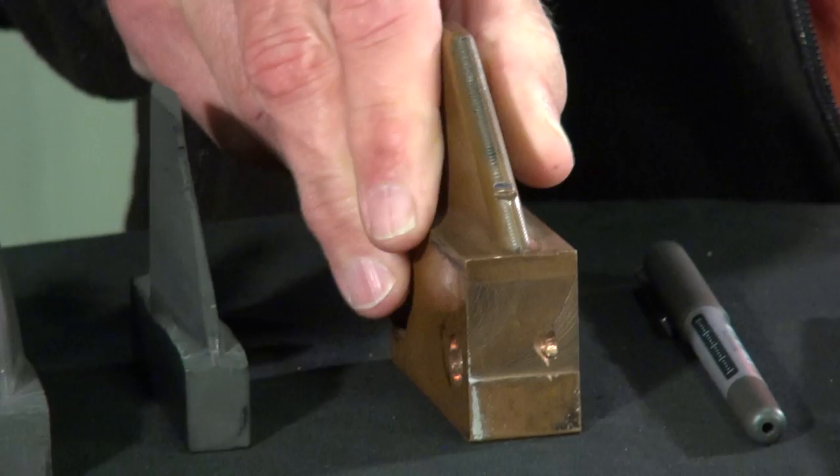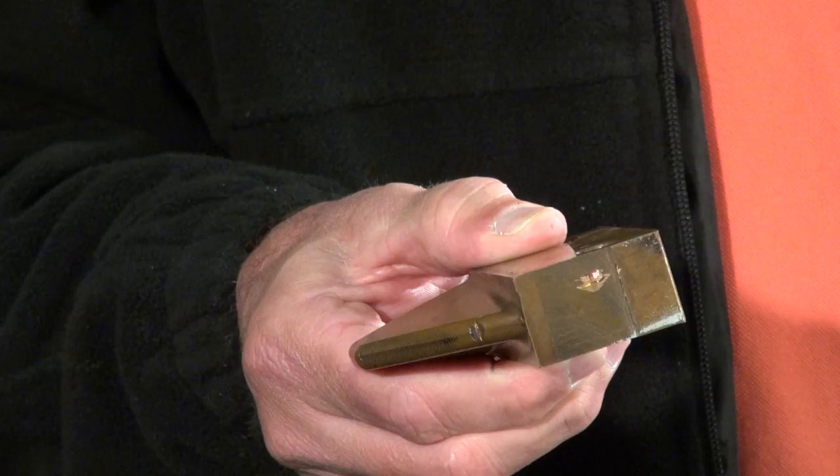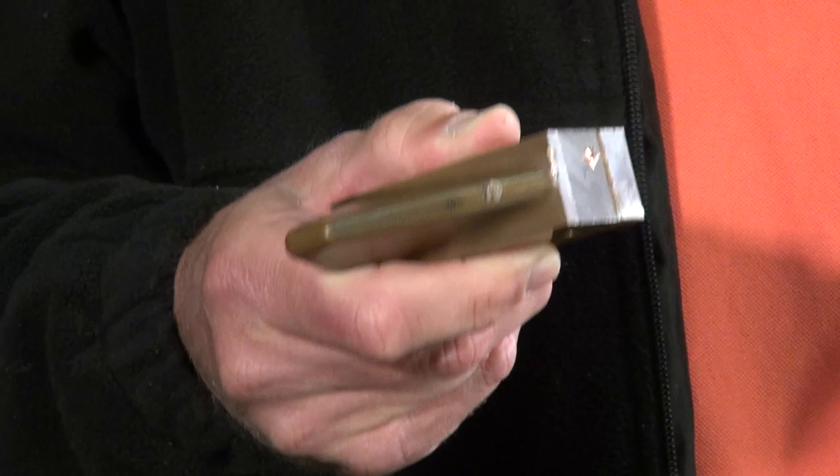It's quite beefy. Since it doesn't burn away like the graphite, all the energy goes into it and must be absorbed. So the reason it's so beefy is it's actually one big thermal reservoir. It has a limited lifetime — during the whole burn this chunk of copper gets warmer and warmer, and at some point the whole block will reach its melting point and just fluff away. That's why copper is used: it has a heat conductivity that distributes heat into the reservoir before local overheating, and a good heat capacity so you can store energy in it before it dies.